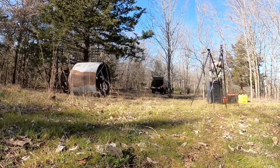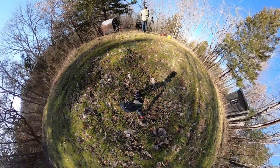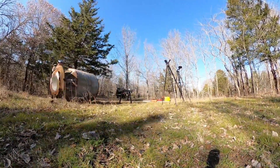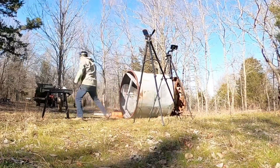What a letdown. Even while using a tiny hot wheel, we never broke out of the 500 feet per second region. Either the packing tape is too strong and slowing the hot wheel down on exit, or our sensor is reading incorrectly — because this is even lower than with no vacuum on the barrel at all. The setup and teardown takes quite a bit of effort: lugging around a power source, compressor, vacuum pump, and a bunch of other stuff. Now that I completely need to redesign the barrel, I think we're going to have to have a Part 3 where we really push for it. We are not giving up on supersonic, but it's going to take a rethink and a little more time. Thanks for watching — see you soon.